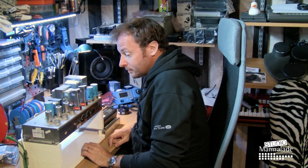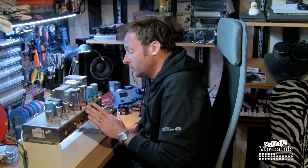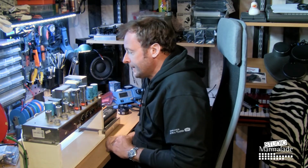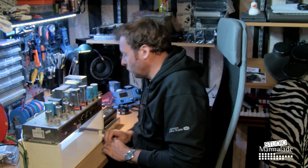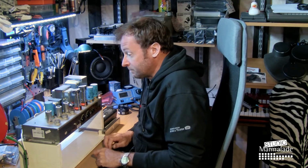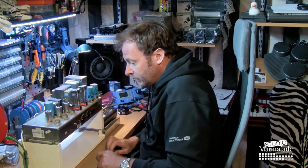I also noticed on the PCB that it actually says 1959 SLP, and the 1959 is of course the 100 watt model with 4 EL34s. It must be a slightly bigger chassis as well, because they wouldn't fit in this. So I guess they use the same circuit board for the 50 and 100 watt model, which makes sense, because the only difference should be the number of output tubes and some small differences in the power section. I mean, the preamp section, which is basically what is on the printed circuit board, is all the same no matter if it's a 50 watt or 100 watt amp. It makes sense, but I'm a bit surprised, because I was expecting it to say 1987, which is the name of the 50 watt